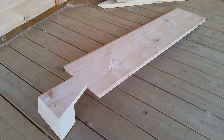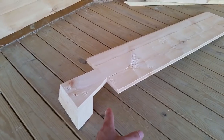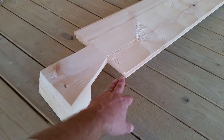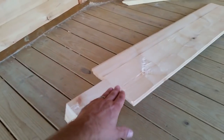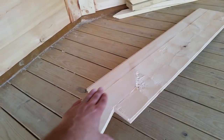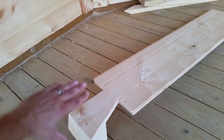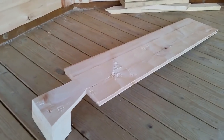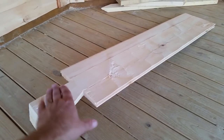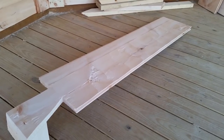Here's one of the pieces of log siding — you can see the dovetail just has a thicker piece on the end to wrap around the corner and interlock the other pieces. They are a tongue-and-groove siding, so there's a groove here and a tongue on top, and the very top is smooth for a chinking surface, in case you want the chinked log appearance with white chinking making those white lines between your logs. This portion starts out about an inch and a half thick, then they hand-hew it to give those axe marks, which brings it down closer to an inch thick when done.